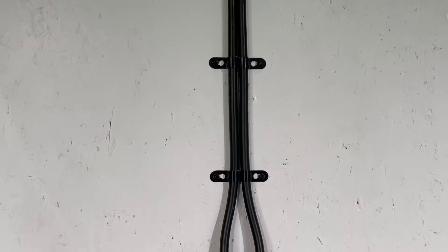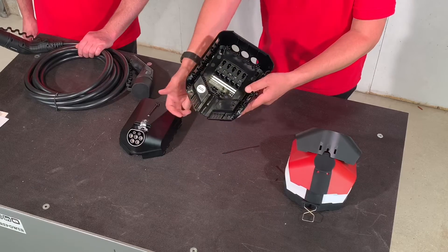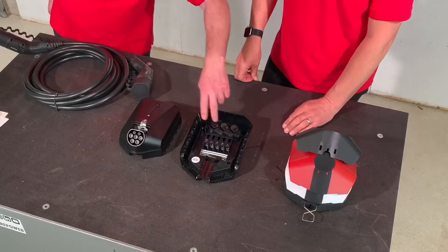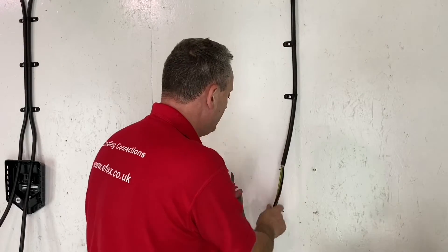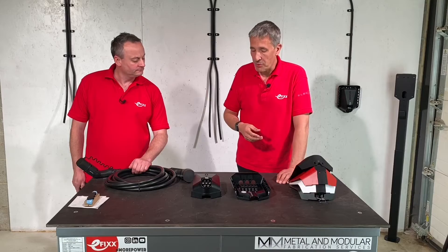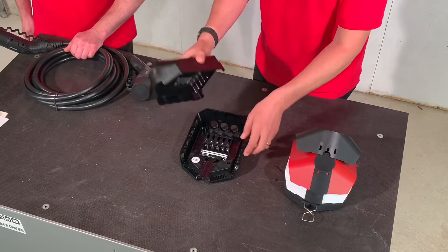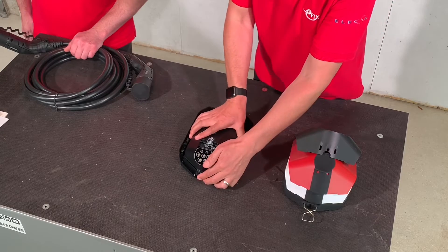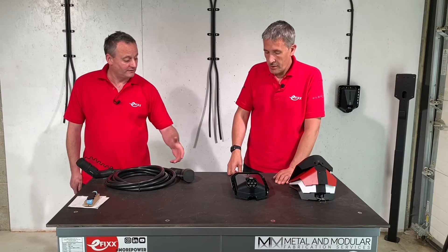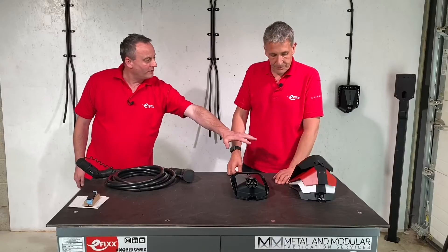Water can come in but also get out — there are various holes at the bottom. There are lots of cable entries, so you can loop in and loop out. On our install we'll go in these top entries, but you could also come from behind or underneath. There are cord grips to secure the cables. We're going to be using high-tuff cable, which is essentially armored cable without the armor — that's becoming quite frequently used on EV installations. When you bring the two parts together with the plug-in connections, drop it in place, slide together, a good click, and the unit is now rated at IP 54.